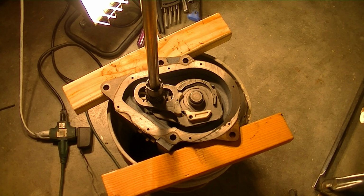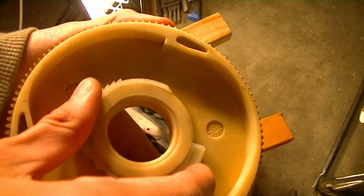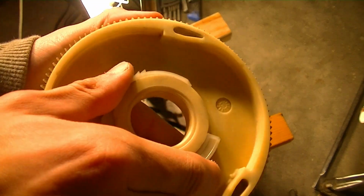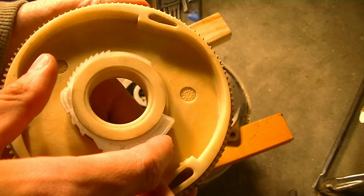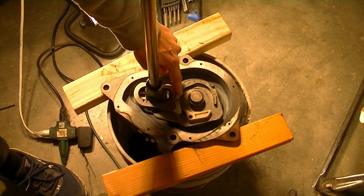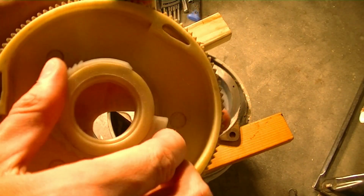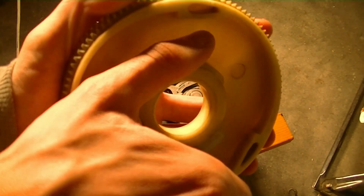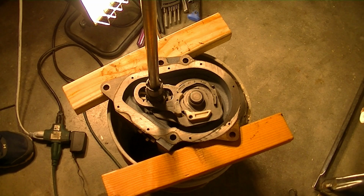And then the spin gear, which has this tang which I was telling you about. If you can tell, it's spring loaded, so it has tension on it. When these pieces like this and this catch on the teeth on this piece, it'll freewheel on the hub of the spin gear like so. And that plays a key role in providing the neutral drain mechanism for the direct drive transmission.